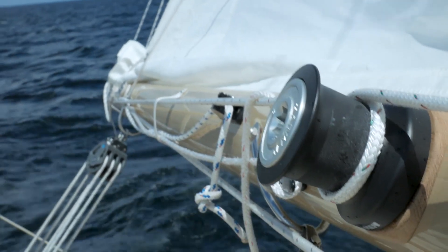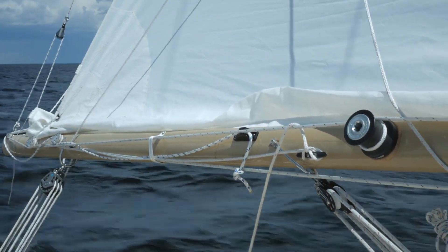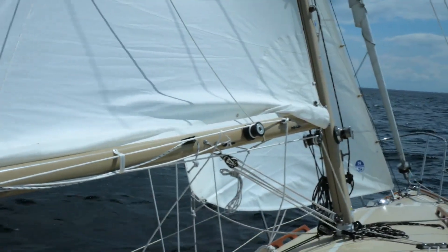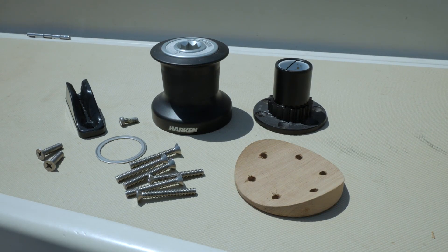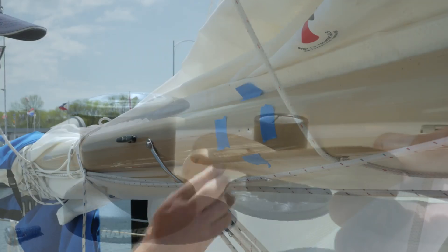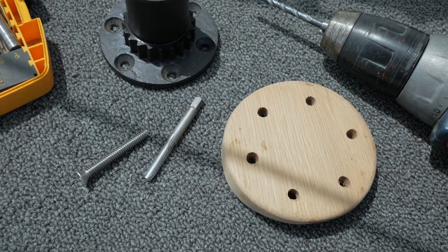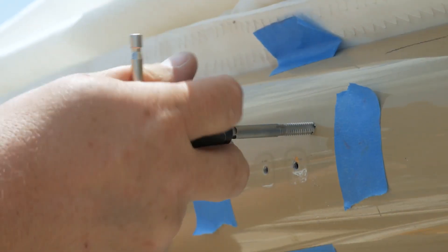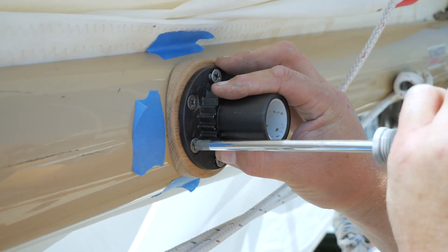The second add-on is a small winch on the boom for the reef line. This way you can wrap the reefing line around the winch a few times and snug up the foot of the main. It gets it nice and tight in a hurry, especially if you use a winch handle with it. To add the winch on the boom, you will need to make a curved base for it to mount to. I made mine from some scrap white oak I had lying around the shop. I shaped the bottom with a belt sander to match the shape of the boom. The holes in the base have the same hole patterns as the winch base. The next step is to drill and tap a set of holes into the boom, then fasten the winch and the base onto the boom with machine screws.